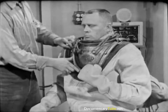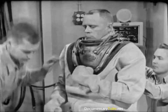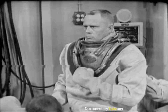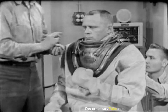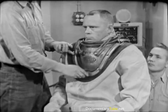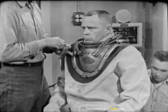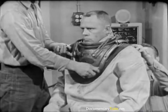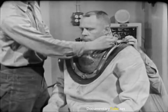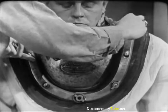Next, the breastplate straps. These are custom fitted in the manufacturing process, and each of the four straps must be placed in its own particular position. Getting them in the right place is easy — the front straps are clearly marked. The tenders now install the 12 wing nuts on the breastplate studs, being sure the flanged wing nuts are over the strap joints, and hand tighten each one.